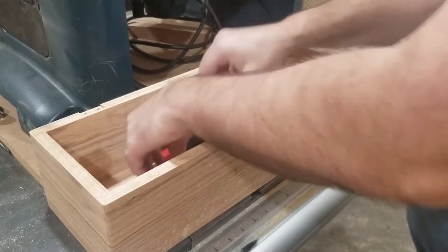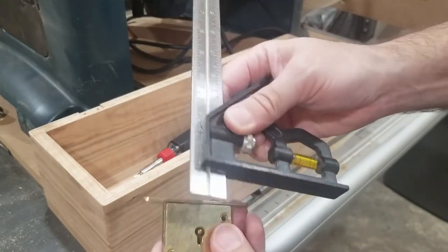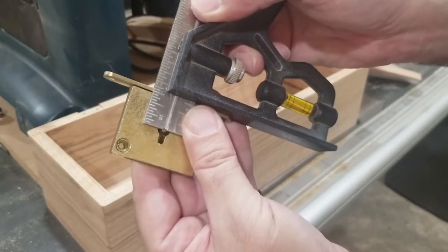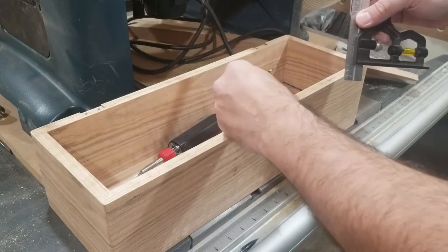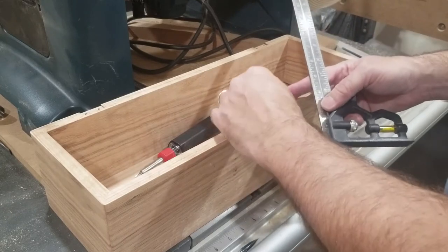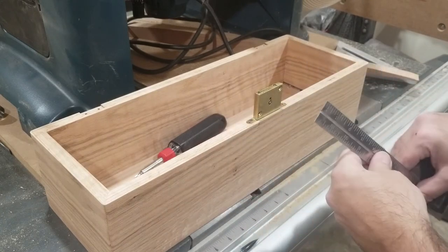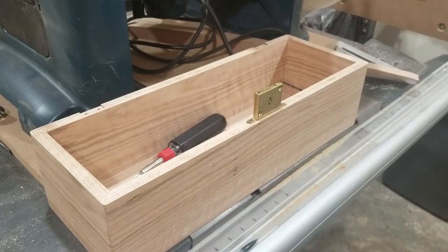and then run one right underneath and see if we can get the correct size. Now, the way we're going to mark the depth of this hole is using this square adjustable, and we're going to put that point right down there in the middle. And we know from when we set this up that we're centered. So this hole comes in the center. As long as we did everything properly, which hopefully we did, this should be centered properly, and we should be able to get our hole proper. So let's see if that works.